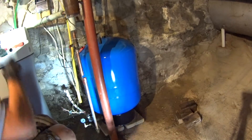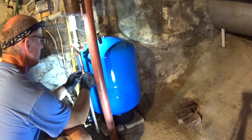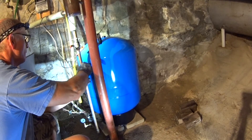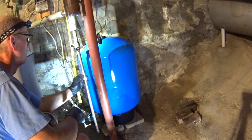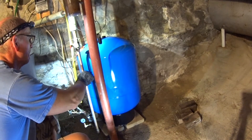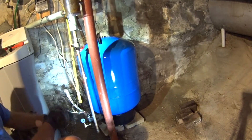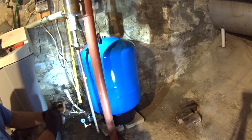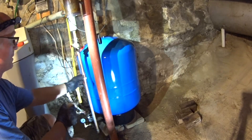I'm putting the big, heavier piece on top — I don't know if it makes a difference, just what I'm doing. I'll get this all screwed together. You want to get everything in line. It's just hand-tightened here. You don't want to solder it in free space — you want to keep the nut on because the union needs to be assembled. You want to solder it pretty much in position.